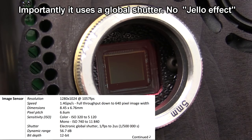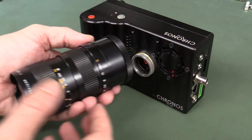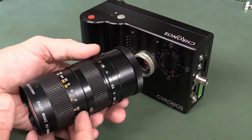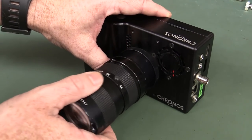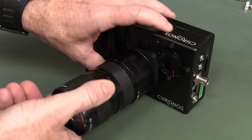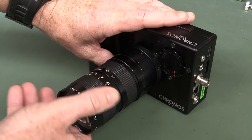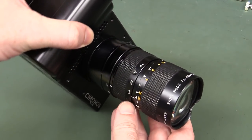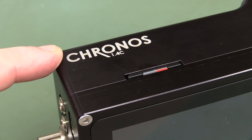I don't know what sensor is in there — maybe Dave can tell us. It's a standard C-mount lens interface, and the C or CS mount lens is industry standard for security cameras, microscopes, and other high speed industrial cameras. So he's really chosen the correct interface there. He's supplied this lens, though it won't actually come with a lens — you'll have to buy your own. He's just given me a secondhand Fuji security-type camera lens on this thing, but it should get this puppy up and running.